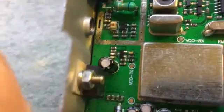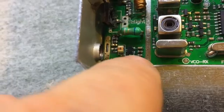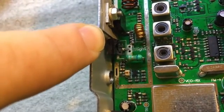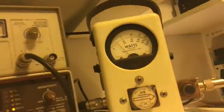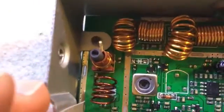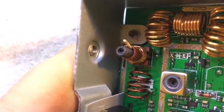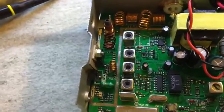The first thing is trying to get it to work. There's a pre-amplifier there which is working, amplified by about 10 times. There's a second pre-amplifier also amplified by about 10 times. It goes through the inductor, then those parts, then to the driver which is amplifying properly now, and then to the final. I also found just down there a pair of surface mount parts in series with the adjustable coil, and one of them was sideways — it was basically shorting out. That probably wasn't helping, so I've corrected that.